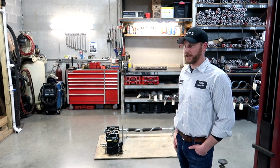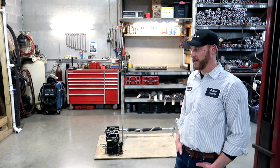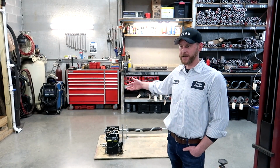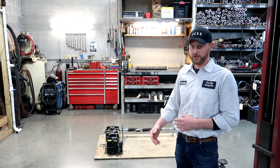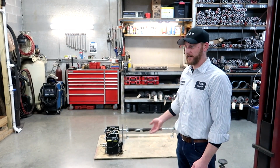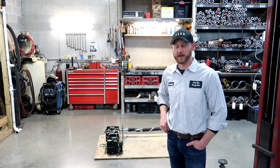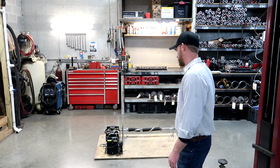I think we had 20 turns on it, and we were winding that thing up and back for probably a solid, if you add it all up, 8 or 10 hours that this operator was running. It was probably 4 or 5 hours at a time, just up and back. I had the timer to close set at 1 second, and literally when it hit the close limit, it would go right back open. So basically for 8 hours, it lifted with 1 second breaks in between. It lifted an 8x11.5, and in the other case it was like an 8x19 foot tall door, up and down nonstop for 4 or 5 hours at a time, with 1 second breaks in between each direction of travel.